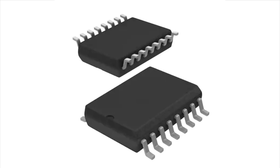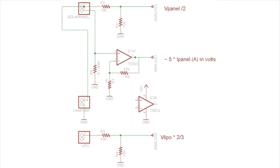Current sensor is actually taking good advice from the medical community and staying isolated from others, like their circuits. So this is an isolated current sensor. So how do we normally measure current? Well, this is like an old project I did. A common way to measure current is you have a very small resistor and it's either on the low side, between the device you're measuring the load of or the draw of and ground. And then you have an op amp, you see here in the center. And it has like a high gain, maybe like 100 or 1,000. And then after you amplify that, you measure the voltage and then you divide by the gain and the resistor, and it tells you the current.